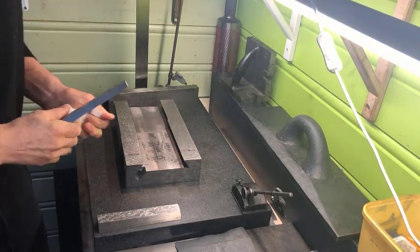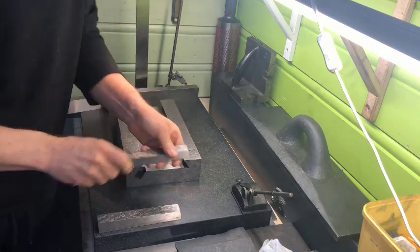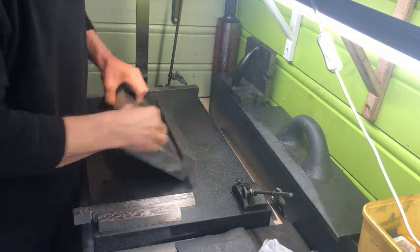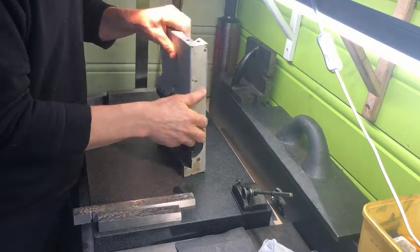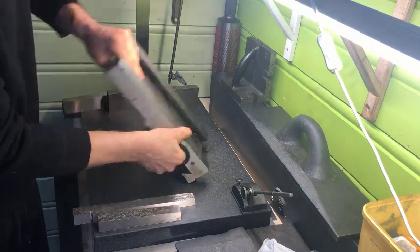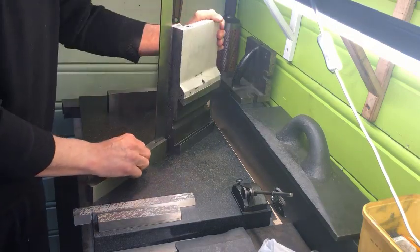The time has now come to test that both dovetails are correctly aligned to one another. As you remember, I have scraped the fixed dovetails on both sides to the reference planes. I also took the time to show how to scrape in references like so.